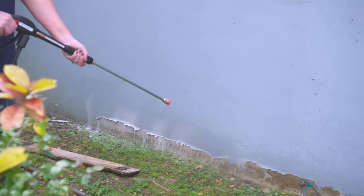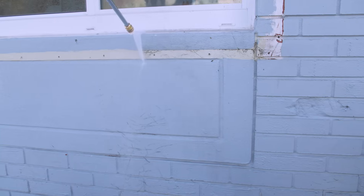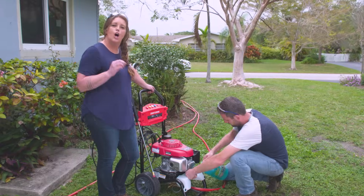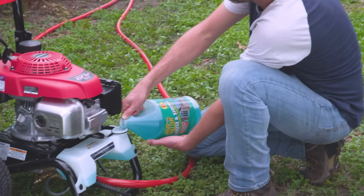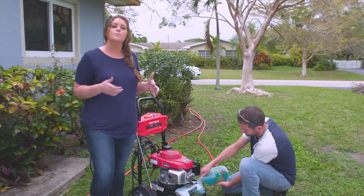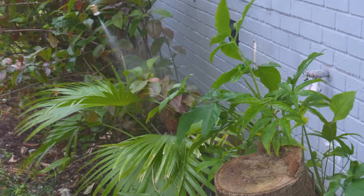For this house, it's going to be a two-step process. First, we'll use the pressure washer to apply a cleaner, and then we'll come back, switch out the tip, and pressure wash the entire thing. We'll apply the soap from the bottom up, and then for the pressure washing, we'll start from the top down. We're using a basic all-purpose cleaner, which works well here because we have a combination of block, wood, and brick. This is a plant-safe cleaner, but we'll also spritz the surrounding plants down with water so they're not absorbing too much cleaner from the ground.